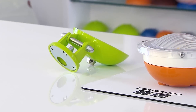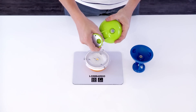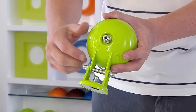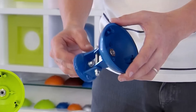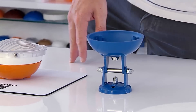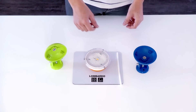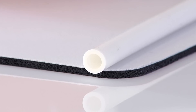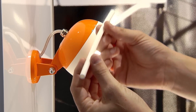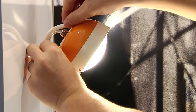The arms are made of die-cast aluminium and provided with a nickel-plated brass cable gland. Wiring is done by passing the cable coming out of the wall through the hole and inserting it into the fitting by means of the cable gland. The product is IP66, so a sheathed cable must be used to maintain this level of protection. For indoor installations with normal single-pole wires, a sheathing is provided, though this is only a styling element and does not guarantee compliance with the electrical wiring standard.